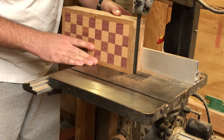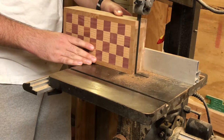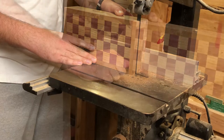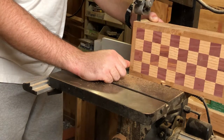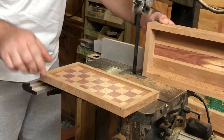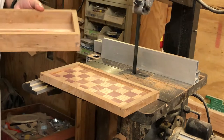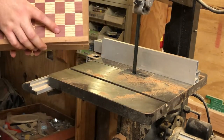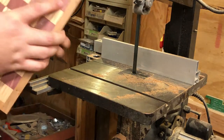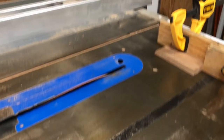Because it was completely sealed, I still had to cut the lid off. I was going to use the table saw, but figured the blade was too thick and would ruin the appearance of the box joints, so I used the bandsaw instead. I went slow, and I'm pretty sure I held my breath the entire time. But it came out just fine in the end. In order to clean up the blade marks and get a nice tight fit, I passed the underside of the lid and the open face of the box frame over the jointer on its shallowest setting.